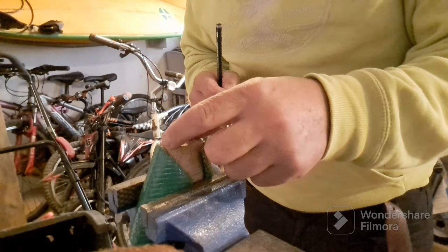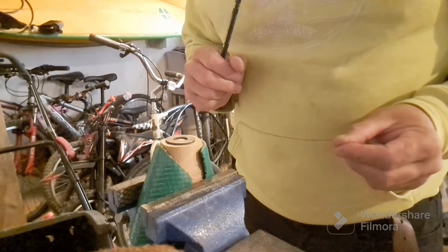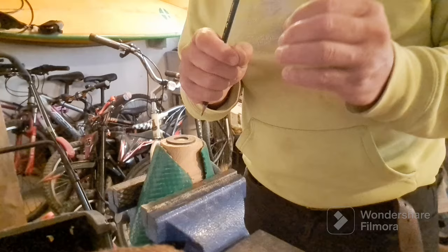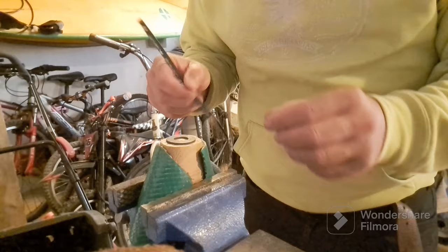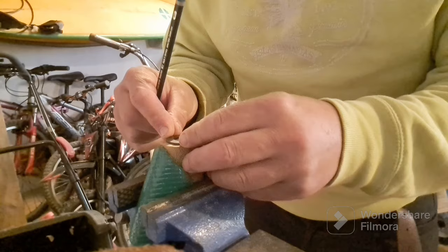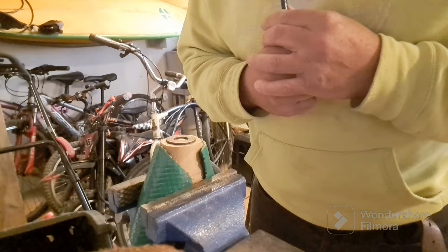Then I'm going to get a little washer with a hole, and I can place this around on the top like this, till I can actually look and visualize that I have a really good match for it being center and leaving enough of the outside wall in all areas. Now that cross I drew was only an indication of where to start, but as I move this actual washer around, I can already see that it was inaccurate. And I think that's exactly where I need to be.